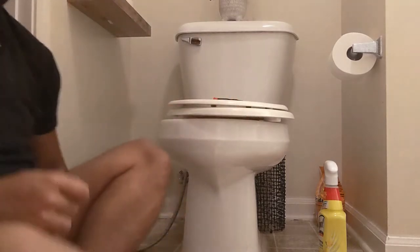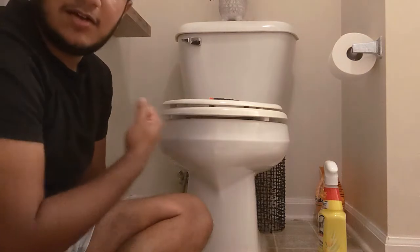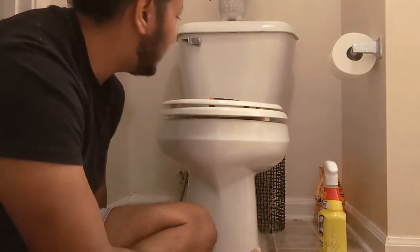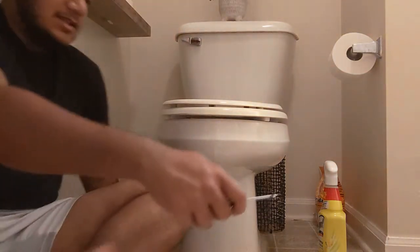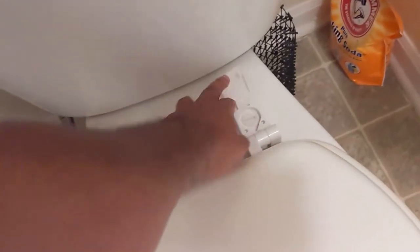So this has a simple toilet seat lift — I was trying to take out the tabs on the top but that's not how it works. It's much more simplified and easier than what I had to do at my girlfriend's home. I just need to flip the tabs and slide the bidet in. What I ended up doing was just loosening the screws a little at the bottom, then lifting up the top and unscrewing with a flat head on each side so the lid lifts up enough to squeeze the bidet in.